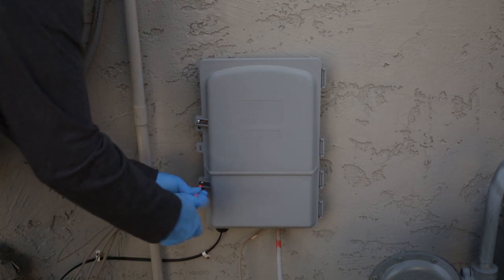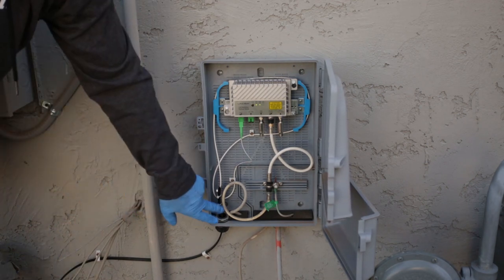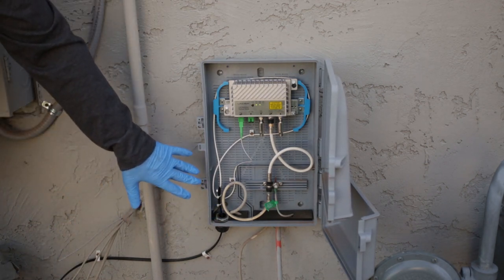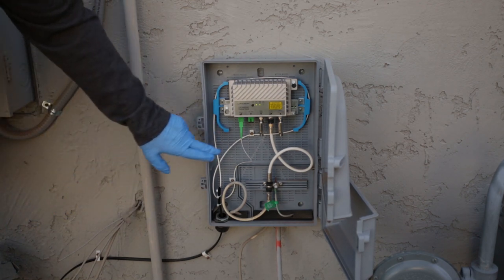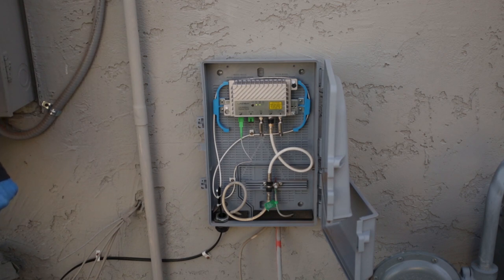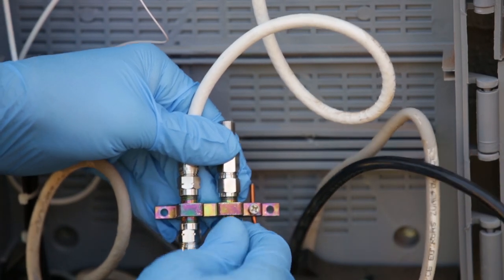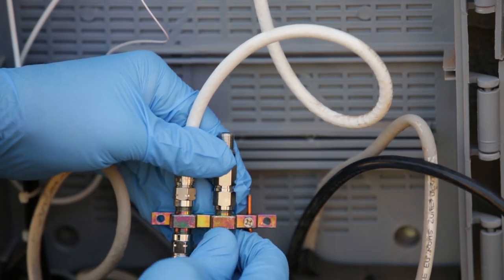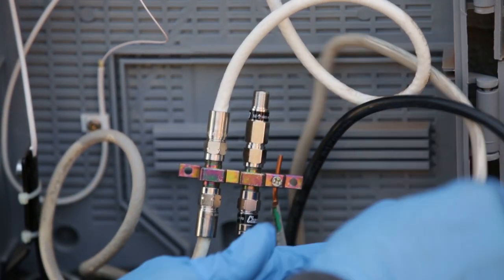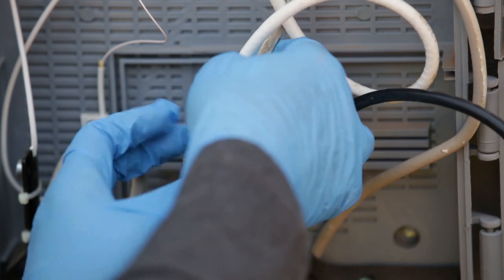Note: you will only find this type of setup with homes that are wired for ultra-high-speed fiber internet. A node is a device used to take light signals traveling along fiber cable from a cable company and convert them into distributable RF signals within the home. Although the homeowner is switching from cable to free TV, they will still be relying upon the cable company for their internet service. Therefore, we have to be careful to only disconnect the cable company's TV signal and not the internet signal. For this specific install, we disconnected the cable company's TV signal from what's called a grounding block. These are used for grounding the system and are compatible with both cable and over-the-air signals. Per National Electric Code, grounding the antenna is highly recommended to reduce risks associated with lightning strikes. For more information about properly grounding your antenna, we recommend referring to the National Electric Code at NFPA.org.